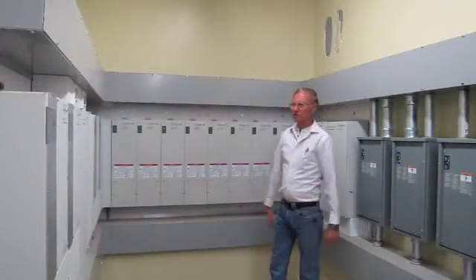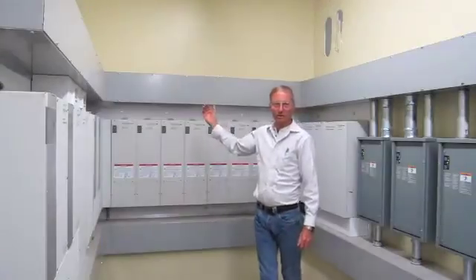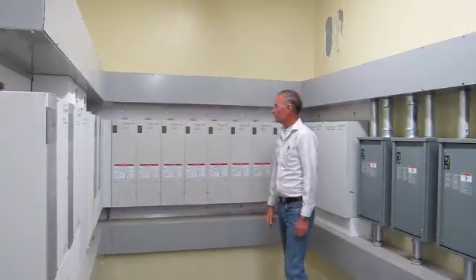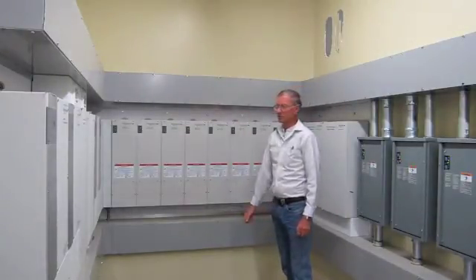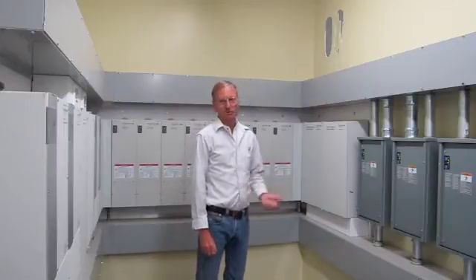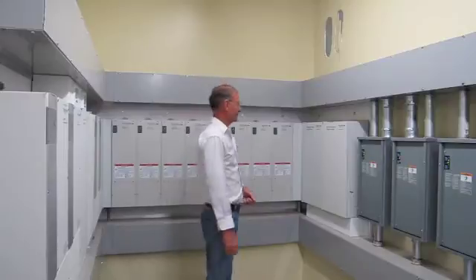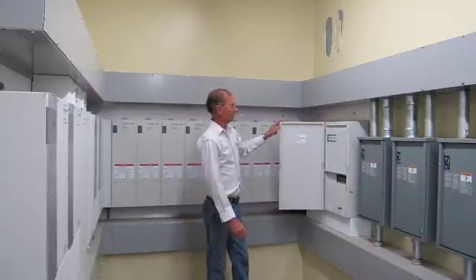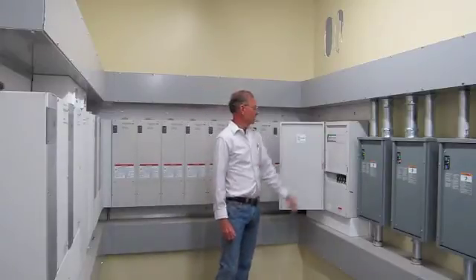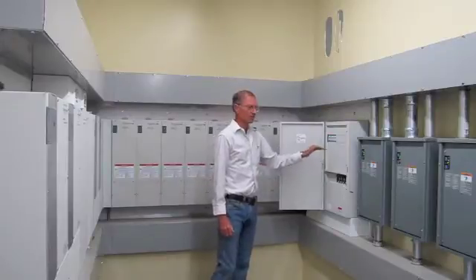Now we're on the other side of the wall. What we have back here are all of the charge controllers that take the higher voltage power from the arrays and step it down to our battery voltage, which in this case is 48 volts. Most of our arrays operate at approximately 300 volts; these will allow them to go all the way up to 600. Because we're up here in the mountains, lightning is a huge issue — we spend probably 30% of our time fixing other people's arrays that they forgot to put lightning arresters on. So there are lightning arresters that filter the power directly at the solar panels, and then these filter it further before it goes into the batteries — filtering above 300 volts up at the panels and as low as 48 volts down here.